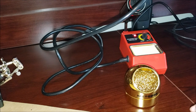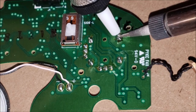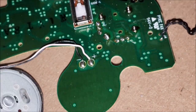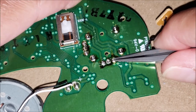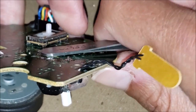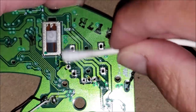What I have here is a very unprofessional hobby soldering iron, and the other thing I'm going to be using is this plunger solder sucker deal. Just kind of tap it through and she comes off. You can see I didn't really do a lot of favors to the circuit board. Alcohol on a Q-tip - I can follow that up with a toothbrush, and dry it up a bit.